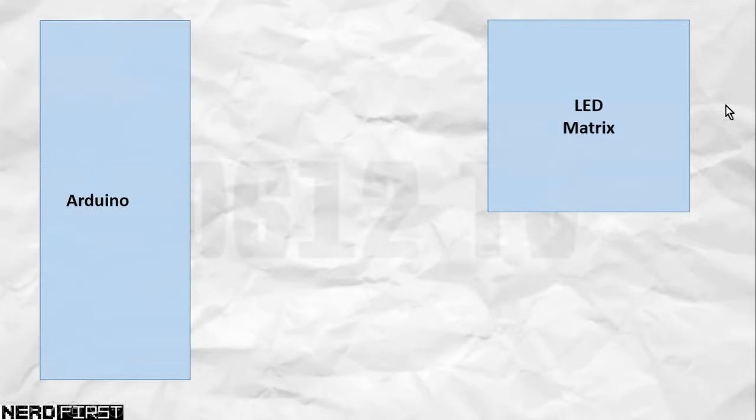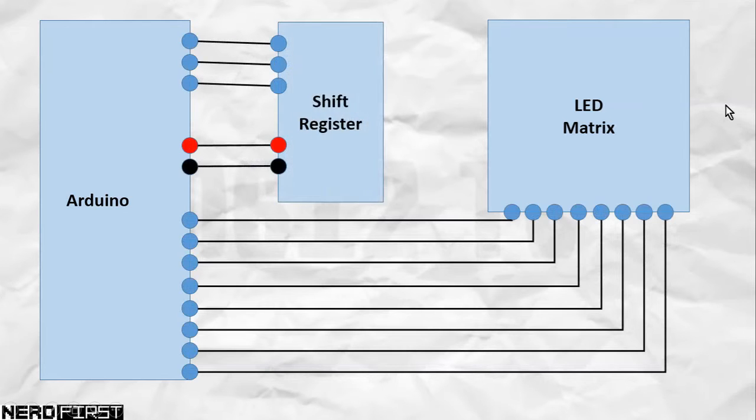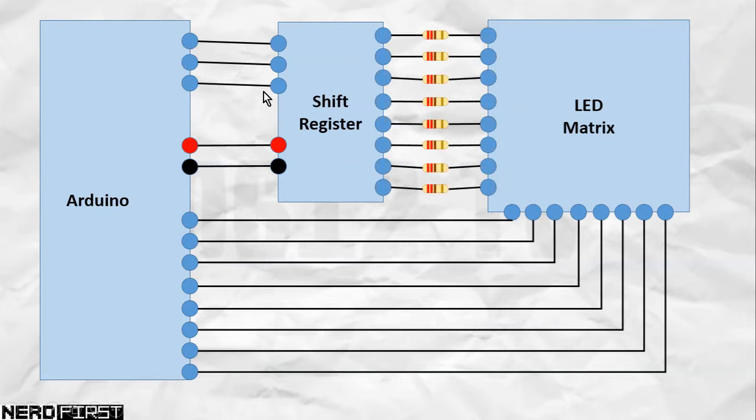This is the first idea I had. We have our LED matrix and we still use 8 pins to actually scan either the rows or the columns. What we save on is by using a shift register - connecting that through resistors - we just use 3 pins to basically control the 8 outputs. So we get a saving of 5 pins. It's not a great saving but it is a start, and by expanding upon this idea we can eventually reach our highly optimized state. There will be a time penalty doing things this way because we will not be able to update all these pins in parallel - instead we have to shift in the values one by one serially.